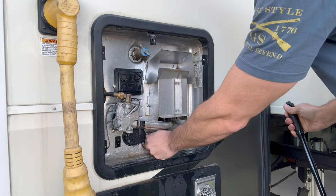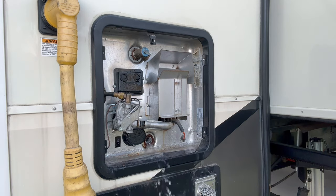What we're going to have to do is empty the water heater first and get all the water out of the tank. We're going to go ahead and change our anode rod since we have to open it up and drain everything anyway. Then we're going to go inside the basement and switch out that old plastic check valve — which I'm guessing is the problem — and replace it with a nicer new brass check valve. Hopefully that should do the trick.